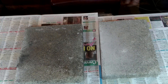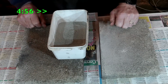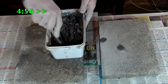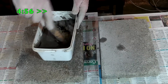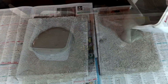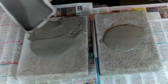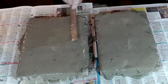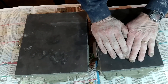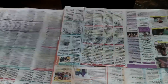This next bit is primarily for these two honing plates, but if you want, skip along to the indicated time to continue with information more consistent with the surface plate. To attach the first of two sets of tiles to the concrete slabs I use tile adhesive, obtainable from high street DIY stores. Mixing the tile adhesive is quite simple — you simply add water to the advised quantity. After mixing, evenly coat the concrete slabs and place the tiles on top, then leave them for a couple of days to fully set.